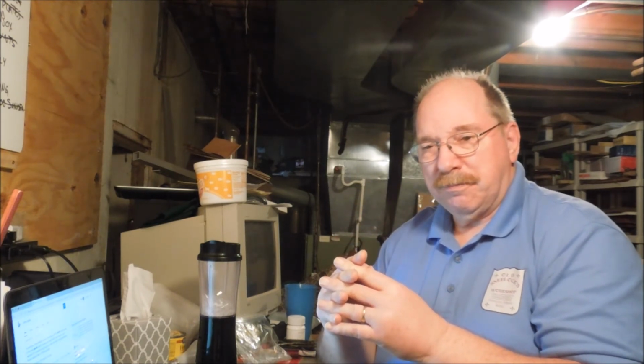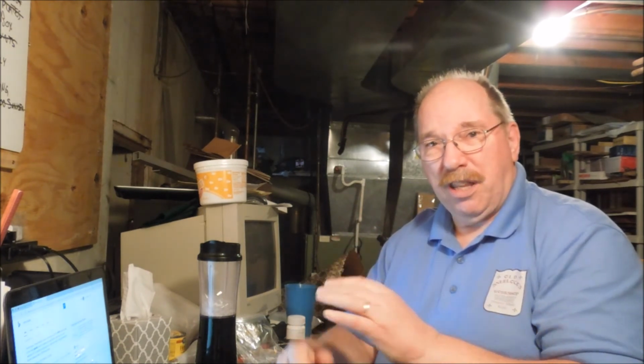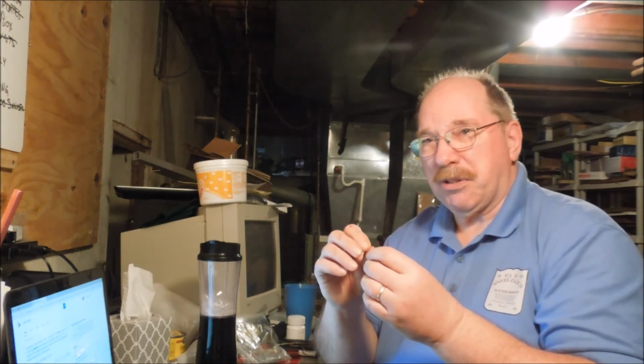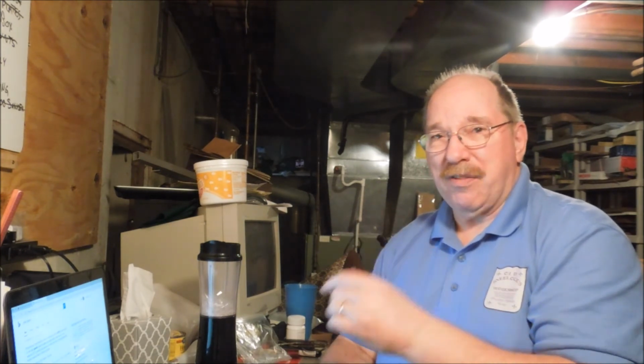The grinders at the plastics plants that I worked at were more saw blades that intermeshed and chopped up the material into fine pieces. The little nuggets that they used to put into the extruder were about an eighth of an inch. Sometimes they were cylindrical, maybe a quarter inch long and an eighth of an inch in diameter, but most of them were pretty much round at about an eighth of an inch.